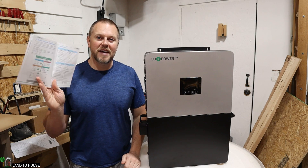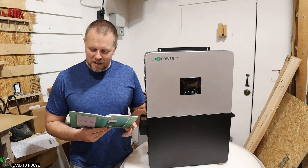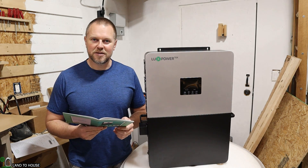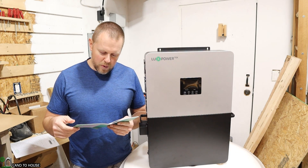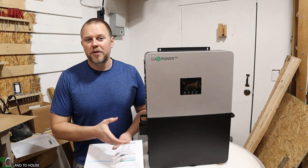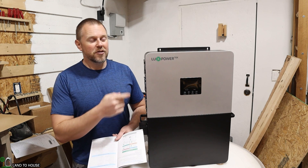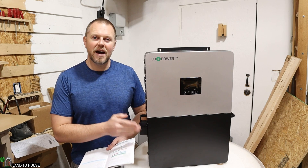Now that you've seen the inverter, I'm going to read off a few of the tech specs. The model number is SNB-NB-US6000. It has a maximum PV input of 8,000 watts — that's 4,000 watts per string with 25 amps at 480 volts input. The rated PV input is 320 volts, which is the ideal to aim for, but it will accept 100 volts up to 480. The MPPT voltage range is 120 volts to 385 volts, so if you can keep your solar input voltage in that range, you'll be in a pretty sweet spot. The expected solar input for my setup will be around 250 volts. The max solar current is 17 amps on both PV1 and PV2, with a short-circuit rating of 25 amps.